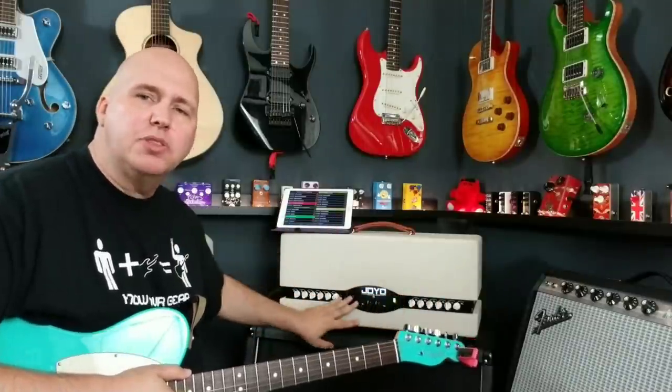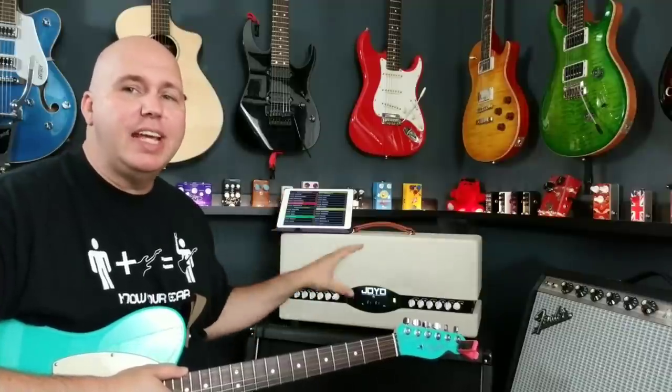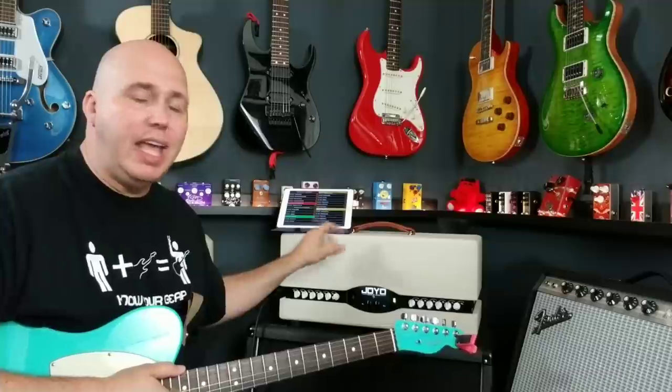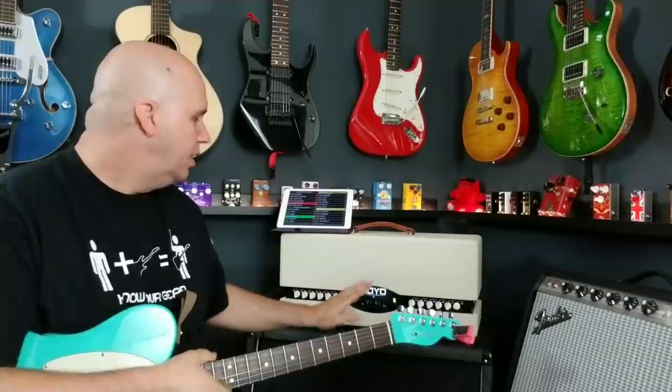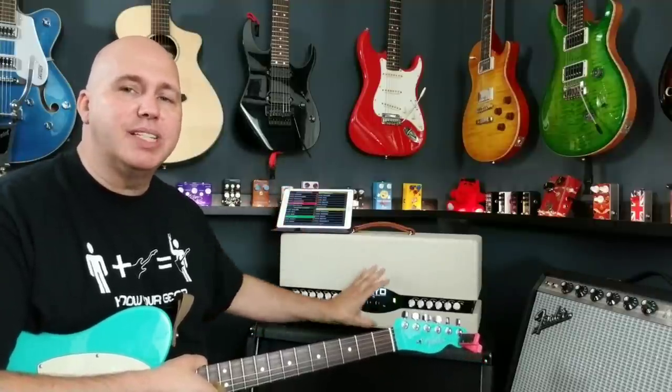Now looking at the front of the amplifier — none of the knobs or controls are digital. They are all analog, which means they cannot be programmed. Wherever the knobs are set, that's where they stay. There's no way to memorize them — nothing in the app, nothing in the amplifier, nothing in the MIDI control software that will let you save presets. Because it uses analog pathing, the only thing it can do is turn certain knobs off. For instance, if you're using a Fender circuit that doesn't have a presence control, the presence control on the amp will be turned off — visible in the app, but there's no indicator on the amp itself.